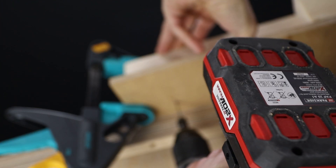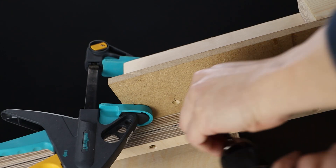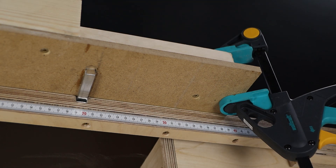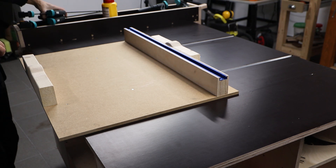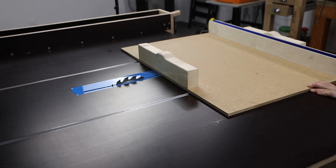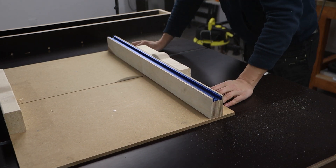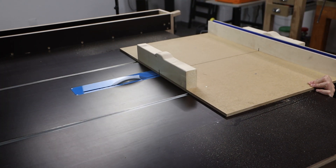As for the main fence, I just used two screws, one on each end, exactly 68cm apart. You'll see later in the video why I had to make this with such precision. I made the initial cut in the sled but I forgot to change the blade to a crosscut blade, so I had a bit of splinter in the wood. To make the fence perfectly square with the blade I used the five-cut method, which I will explain shortly.